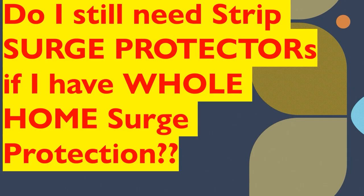You need to go down and check your device often — maybe once a month — and make sure the green lights or whatever indicator lights are on there for your brand are still on. You could have a fried whole home surge protector, not know it, and then not be protected at all. So make sure you're checking your whole home surge protector to ensure it's still functioning properly. I highly recommend still using strip surge protection for your sensitive electronic equipment.